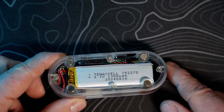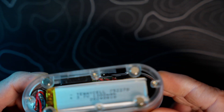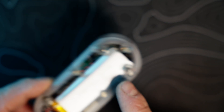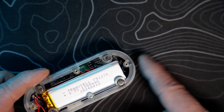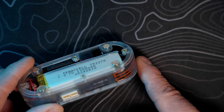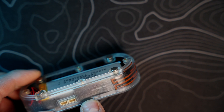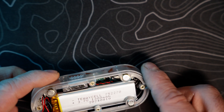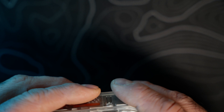You can see all the antennas, though I'm not sure which is which. There's an antenna right here, and one that bends around the housing. I'm assuming this is NFC, and this is probably the sub-GHz band antenna. There's also an antenna down here, which is probably the Wi-Fi antenna — this has built-in Wi-Fi via the ESP32 board.